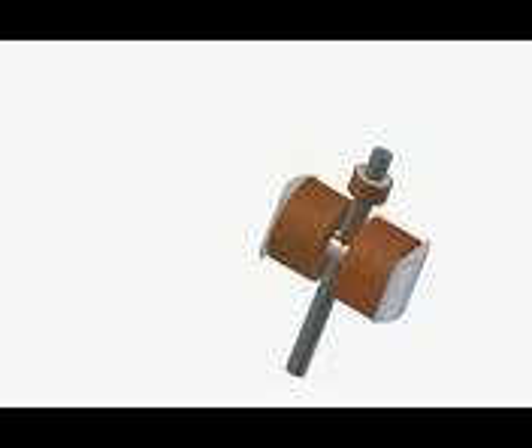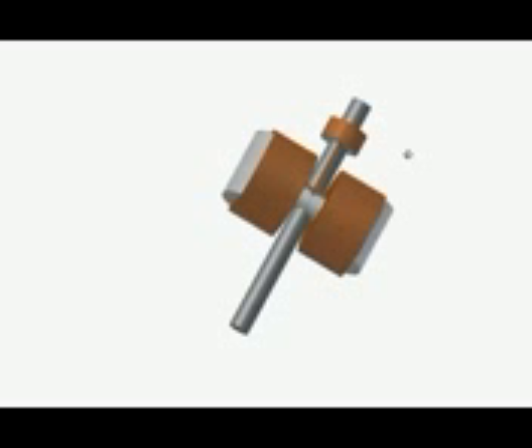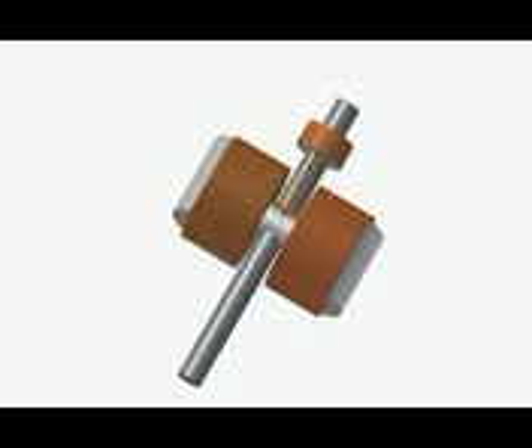So we have made the commutator piece. Now it's time to put something to hold the shaft in position while rotating, and what could be better than a set of ball bearings? The motor actually has two bearings — one above the commutator and one under the coils. The bearings are very important to the motor, and actually the bearings along with the brushes are the parts that wear out on the motor.